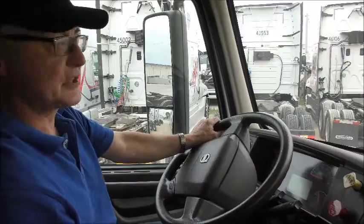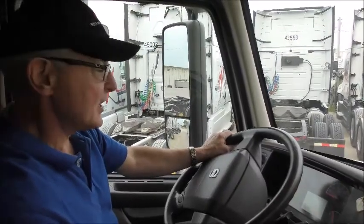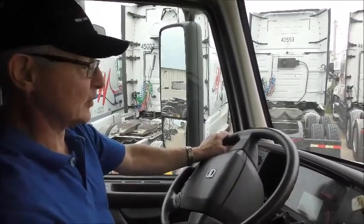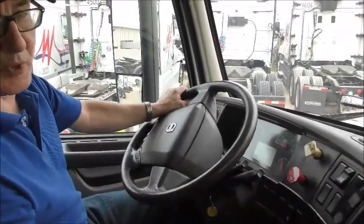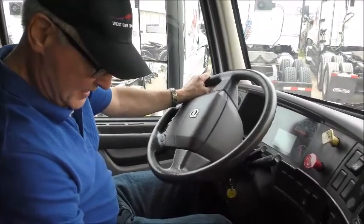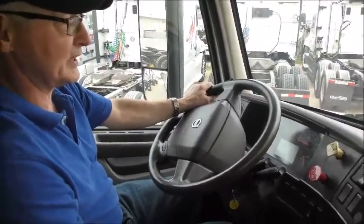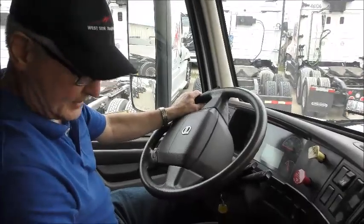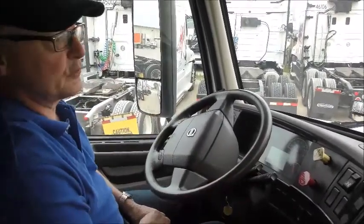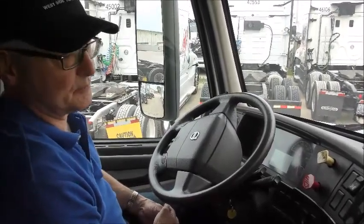Tim Whitney. I work in Westside Safety Department, and we're going to demonstrate unhooking, or uncoupling, a trailer. I've just parked the trailer where I want it to be. I'm going to apply the trailer brake, put my transmission in reverse, and back up just a little bit lightly to take the pressure off the kingpin and the jaws of the fifth wheel so it uncouples, so I can pull the release arm on the fifth wheel more easily.